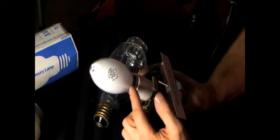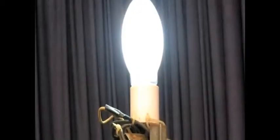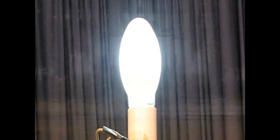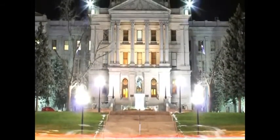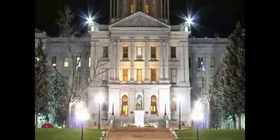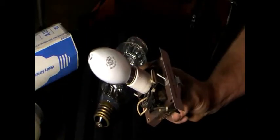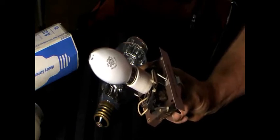A lot of street light fixtures use these deluxe white lamps up until high pressure sodium came around, and there's still some of them in use, and they're easy to identify. Any street light you see that lights up a crisp, cool white color has this type of mercury lamp in it, with the yttrium vanadate phosphor. Probably in a bigger wattage, 175, 250, 400, maybe 700 or even 1,000 watts, depending on the fixture.